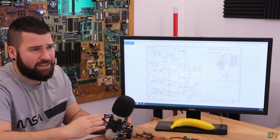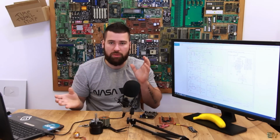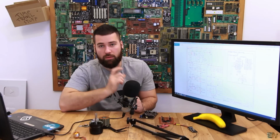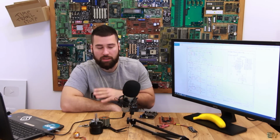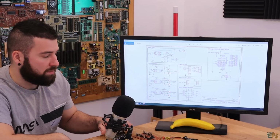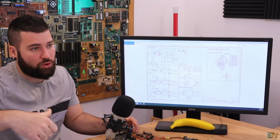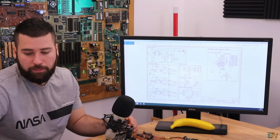It's a lot easier than creating an interruption, detecting the time differences, telling the rising time from the falling time, and then getting the PWM width, the value, and then converting that from microseconds to the speed of the motor. So yes, that will be one of the improvements that I want to make for this PCB: to add a potentiometer control in order to use it with those e-bike controllers, because that is just a potentiometer that will change the analog value.